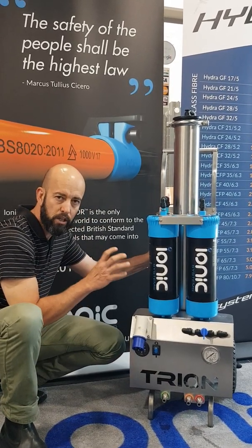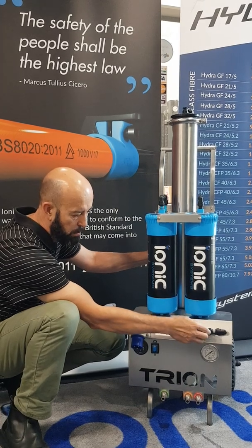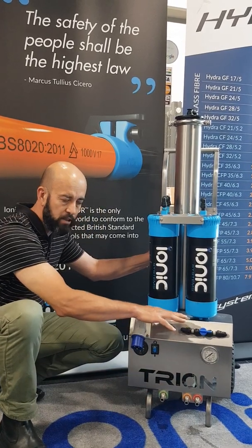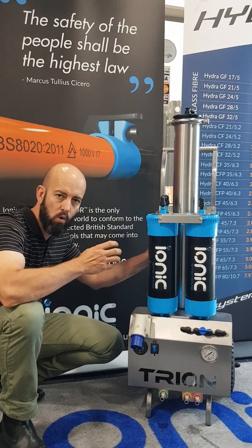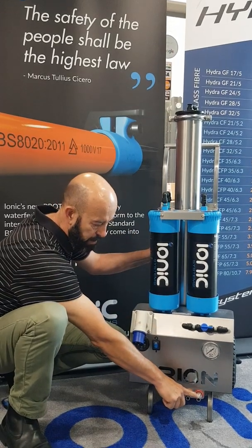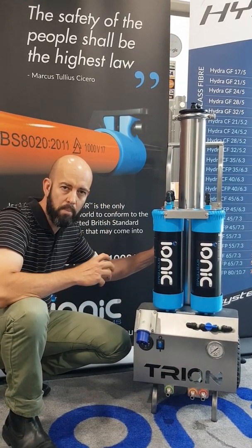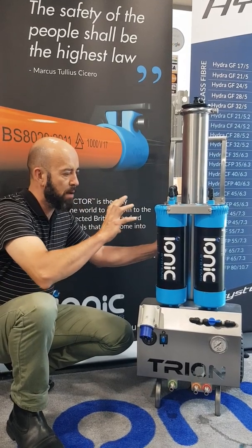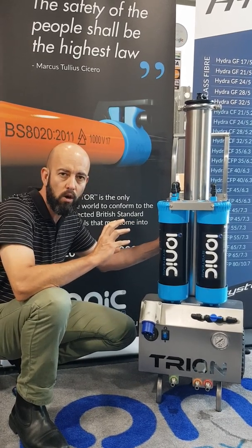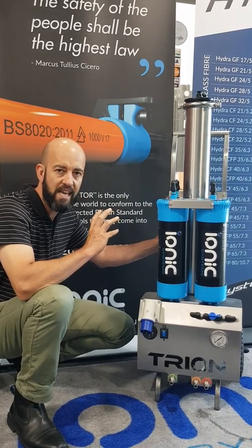At the end of the shift, at the end of the day, we'll talk about RO flush. An RO flush is moving the bypass valve back inline, which will give an increase in reject water and a decrease in pure water. What that's doing as a maintenance procedure is allowing maximum water around the RO so any particulates that have got caught in that RO filter are rejected to waste to drain. During normal operation, the waste water will be directed over somebody's lawn, a garden bed, or down a drain. Carbon filters will do approximately 150,000 litres for the 15 inch. DI resin filters will be on condition and determined by a portable TDS meter, as well as the RO filter.